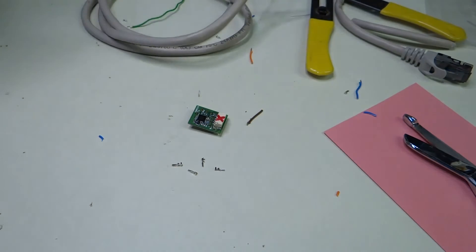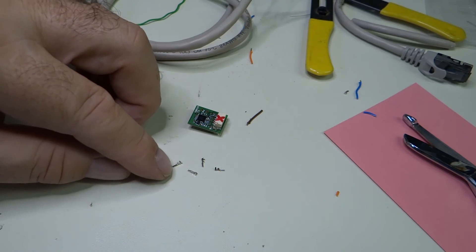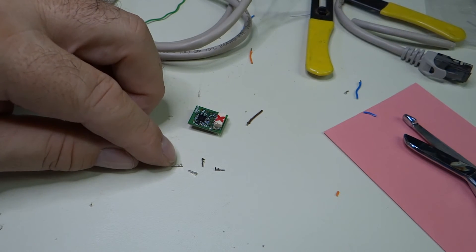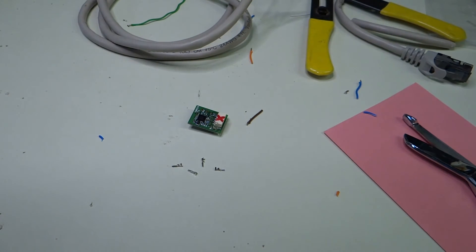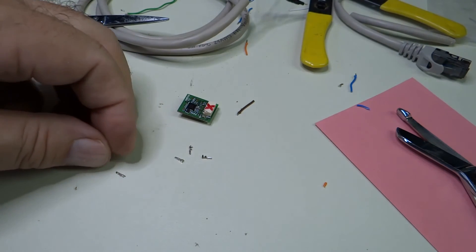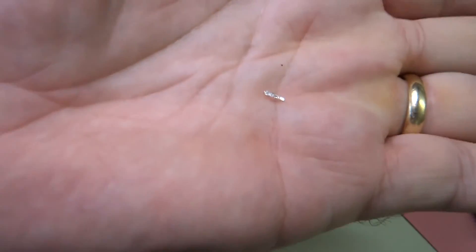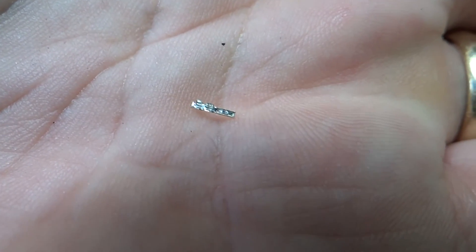When we try to put them in the connector housing, these fins need to be down — otherwise they won't go in all the way. They need to go in and click in for the connector to work, so those pins will get in the way if they're not either removed or bent over. I was able to use this to trim the fins off from the connector — you can see the fins are trimmed off, so now that'll work. We can solder to it and it will work.